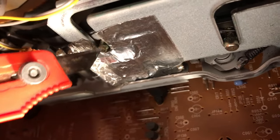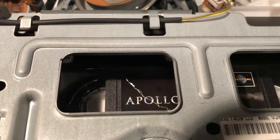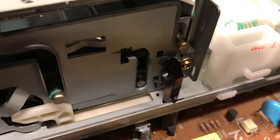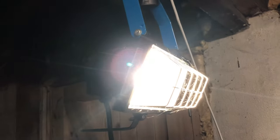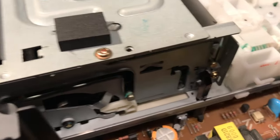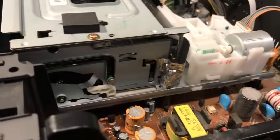That's looking pretty good — I've cut a little channel out for this little moving part. It's working! Now I've got to do the same to the one on the other side. I coloured it in with a sharpie and tested it with my phone light, thought that would be good enough — it didn't trip. But then I tilted it towards this gas discharge tube and it tripped it, so clearly it's to do with the frequency of the light. It's an infrared LED that it's detecting, so light in the more infrared frequency is going to have much more of an effect. I covered it with some foil and it seems a bit better — not perfect, but I reckon good enough.